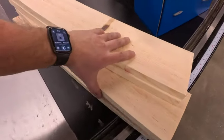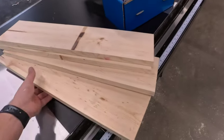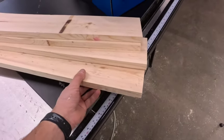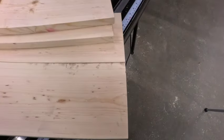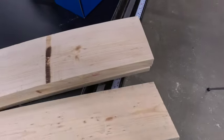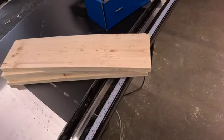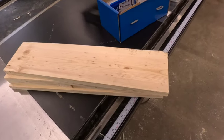I've got those four boards cut. When you want to cut pieces to the same length, make sure you use the same piece as the template — otherwise your variation can get off a little bit more than you want. Just like that, we got them perfect and all the same. I'm going to get these ripped in half so then we'll have our eight total legs, and I'll start building the supports on the sides.